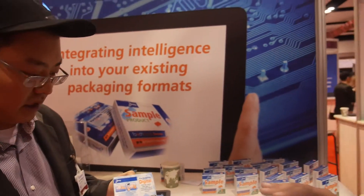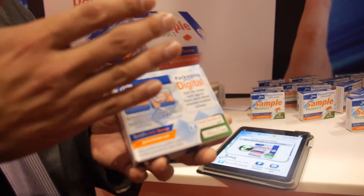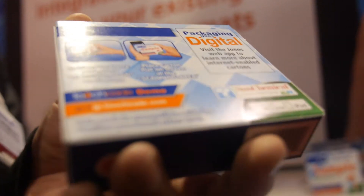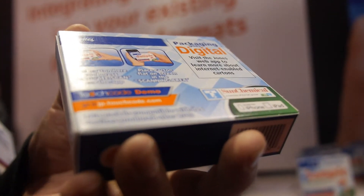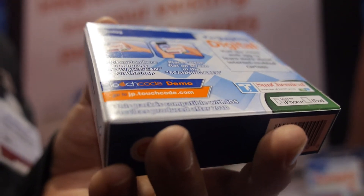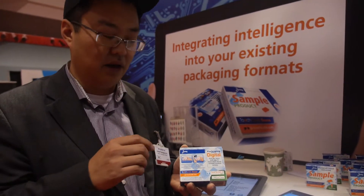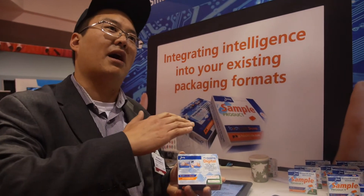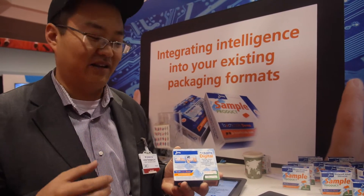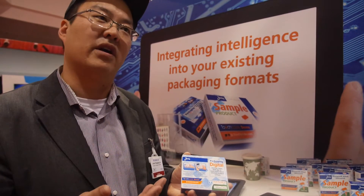Why are you printing the conductive ink? Is that on the surface, embedded in the paper layers, or on the other side? We've actually printed it on the surface. We're unique in the sense that we've been able to print this through a sheet-fed offset printing press. However, we have an anilox coater at one side of the press. We print the carbon conductive on that layer with the anilox coater, then we print whites over top on the same pass. We wait for a day for drying — the carbon likes to oxidatively dry — then put it back through the press and use all the decoratives to cover it up.